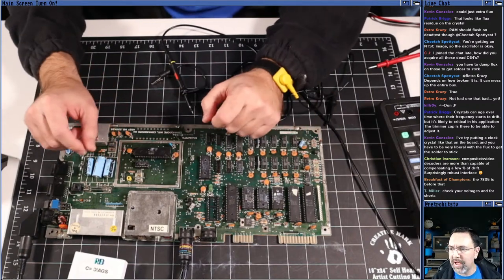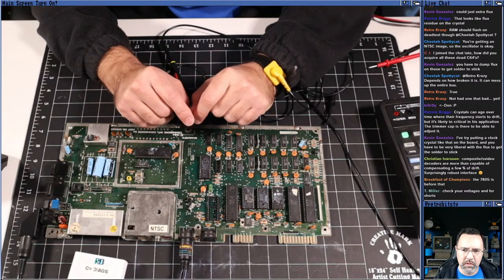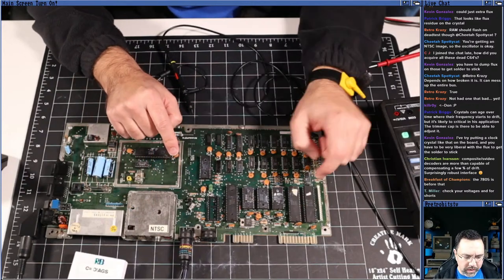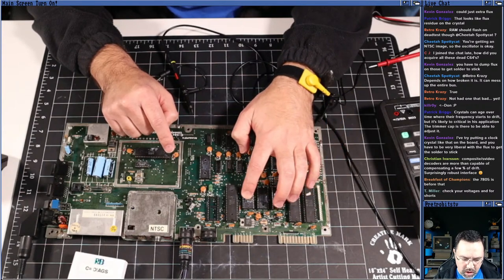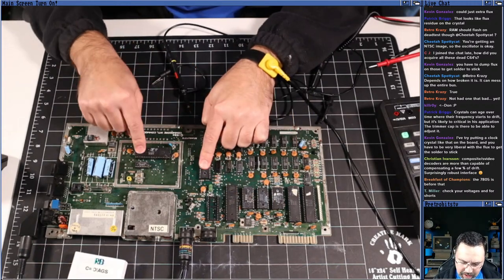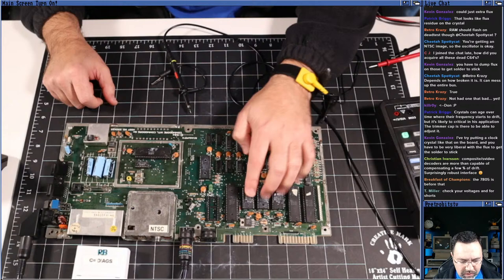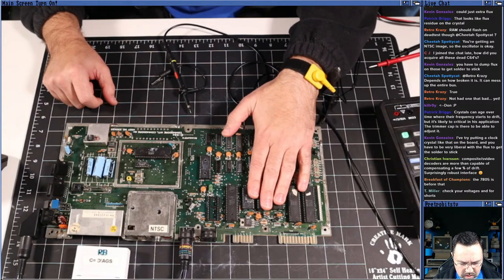We could dig into the schematic and see where reset goes and where it comes from. But I think the first thing that we want to do is just run this machine in a minimal configuration. So you can run a Commodore 64 without the two CIAs, without any of the ROMs. All you need is the CPU, the PLA, and the VIC chip, along with the dead test cartridge. So I think what I'm going to do is I'm just going to pull these guys out of the socket. I don't feel anybody getting hot here,